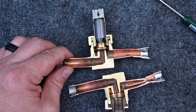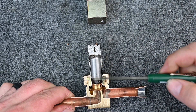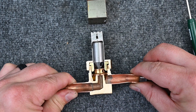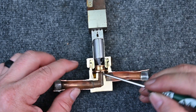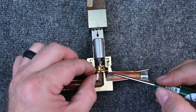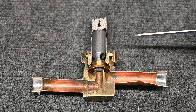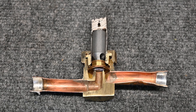Right now the spring is pushing down on this piece, which pushes down on this brass piece, keeping our valve closed. I'm going to move this valve up next to the neodymium magnet and you'll see it pull the pin firmly to the very top. Now we have a gap here — see how there's play in this section? The refrigerant pressure allows this to push up so refrigerant can continue on. When the electromagnet is released, the little spring pushes that pin down and causes everything to drop, shutting off flow.